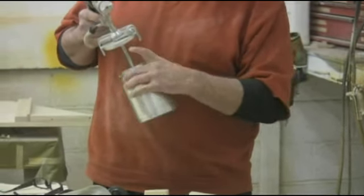Okay. All right. Now, one of the things I'm looking at is the sheen. I'm looking at the gloss behind this. Now, this is not a gloss paint, but it's going to all go on wet. And I see a nice, even sheen. If I saw a little spot looked rough, that means it's dry. In that case, I might just real quick hit it. But we're doing good. Let's keep going.